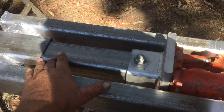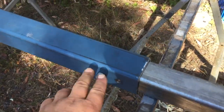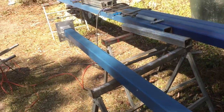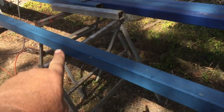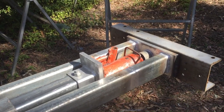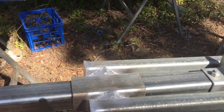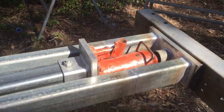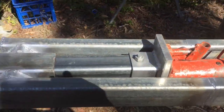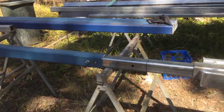It's taken a bit of work to get it assembled because of the thickness of the steel — one sliding inside the other. There's 2.5 meters of this steel inside that one at the moment. This prop from the base through to the top is just on four meters high, so we can get under 4.1, or 4.3 would be better. We can then extend to 5.9 meters and still jack another six inches — 150mm — so we can get over 6 meters.